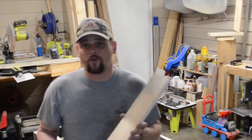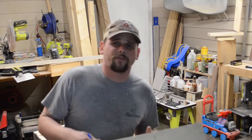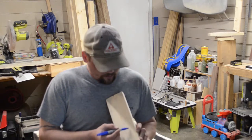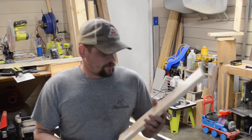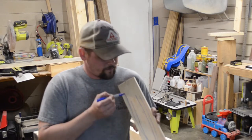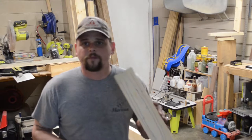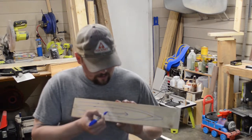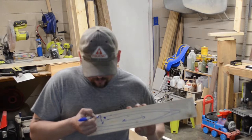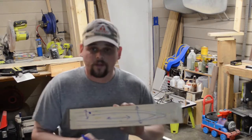So what does that mean, and why don't we want to use pocket hole screws? If you're doing a small cabinet or small entertainment center, something rustic-looking, that's fine. But once you get into larger boards — 2x4s, 2x6s, 1x10s, 1x12s — they're going to change with the seasons, and they're normally going to change in between the growth rings of the wood. The wood won't expand and contract lengthwise; it fills in between the growth rings with moisture and expands and contracts width-wise.